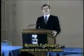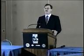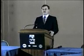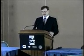Today I'm going to be talking about the new insulation system that we have developed for stator bars in hydro generators. The new system operates at an increased electrical stress, so it's a reduced insulation build, and we've been able to achieve that with a judicious use of new filled materials.